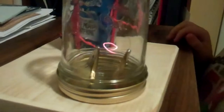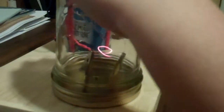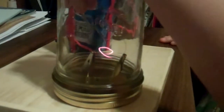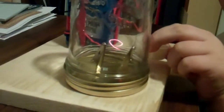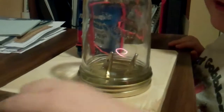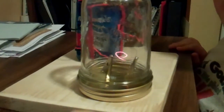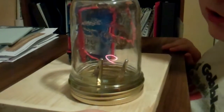What would happen if the filament burned out right there? That means there's too much oxygen in the jar. What could you do to take the oxygen out of the jar? Put a candle in it, light the candle, put the jar on, and then wait for the candle to burn out. Fire takes oxygen to burn, so the candle would burn all the oxygen out of the jar. And then you can plug the thing in.